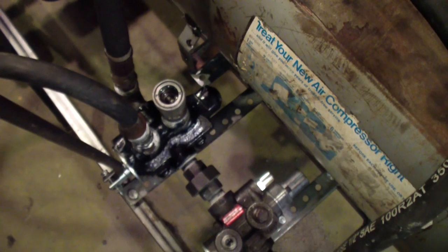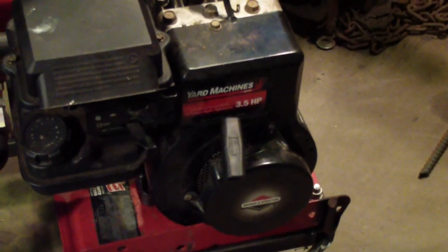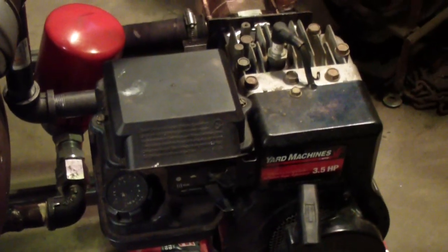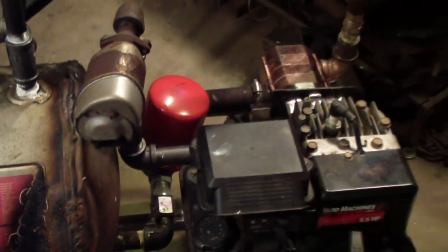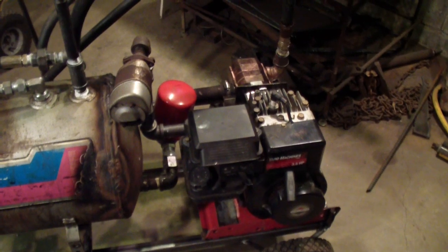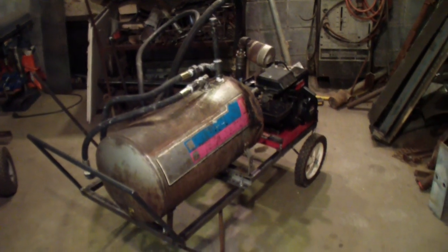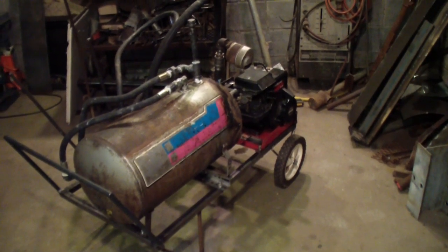I got two quick couplers — this one I still need to get two quick couplers for — but it'll run on just one valve right now. The motor is too small, which I knew it was going to be. I don't know if a six-and-a-half horse is even going to run it — what I have now is a three-and-a-half — and I don't think it'll run the log splitter anyway because it takes quite a bit of pressure to run that pump. I'll probably have to look for something maybe 13-14 horsepower, maybe a used lawn tractor motor, but remounting it should be no problem.